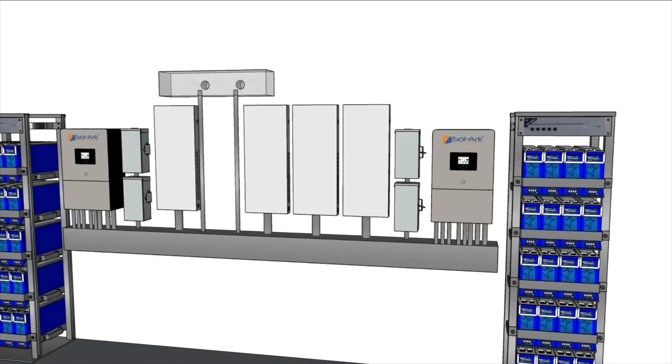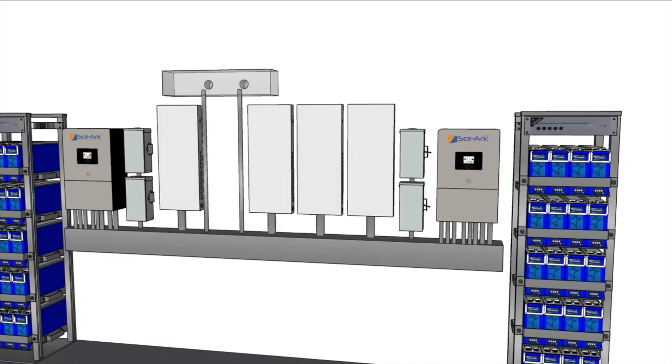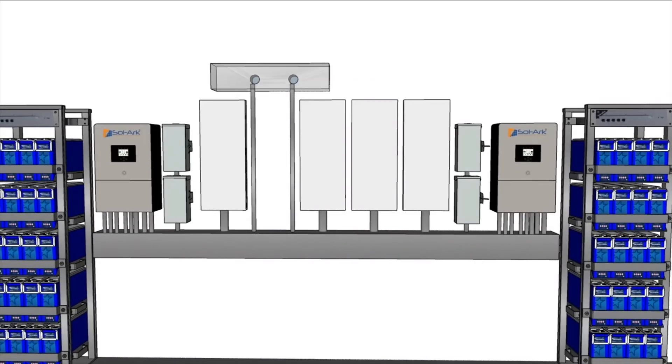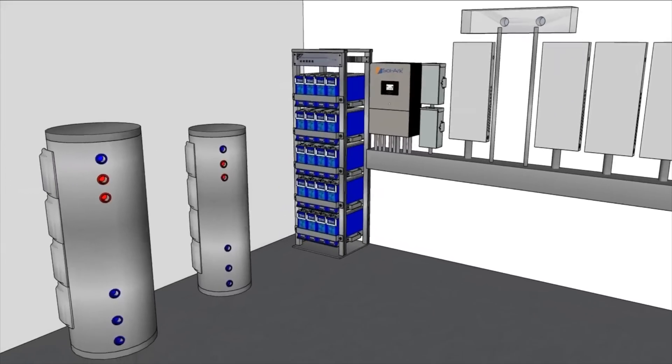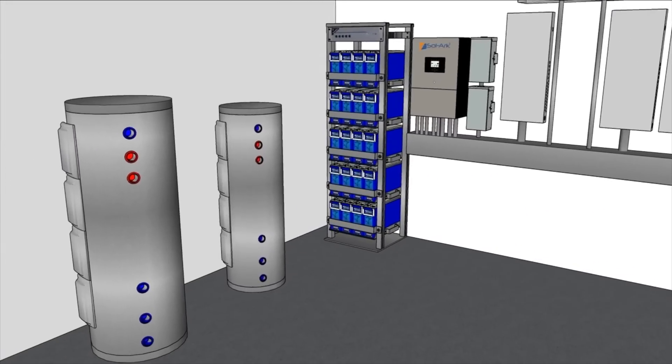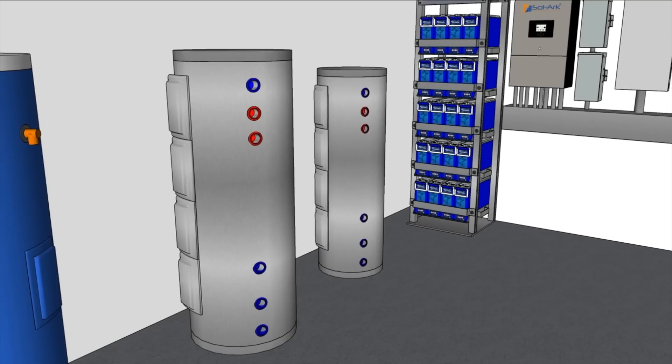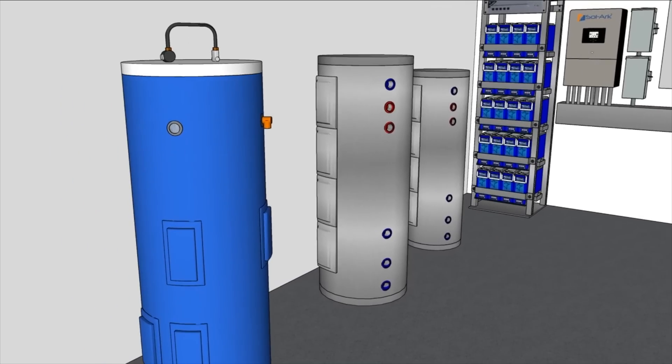We're given a constraint of 210 inches, so the SketchUp model has been really helpful in figuring out how to get all of our components in the mech room — to make them fit, look nice, and be as symmetric as possible. We're also working with a geothermal contractor on the hot wall: where to bring the piping in from the chillers to the buffering tank and the domestic hot water tank.